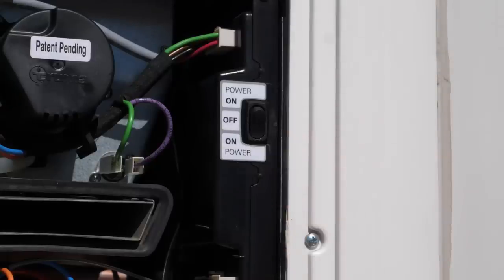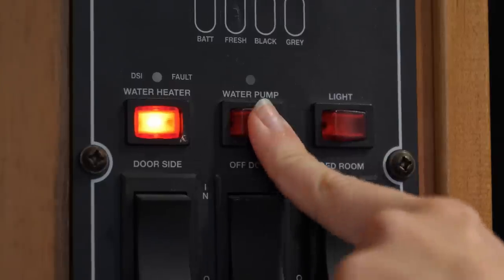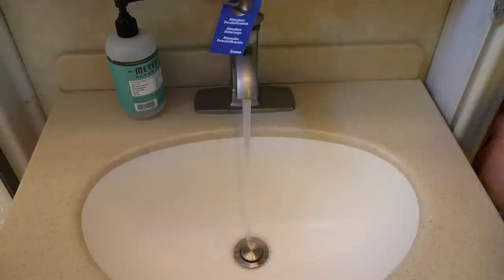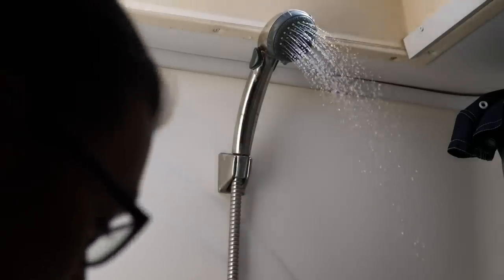Now lift up on the yellow drain lever until it clicks back into position. Switch the power back on at the appliance and turn on the fresh water supply to the RV or the water pump. Open the hot water taps to fill and vent the system. Once water flows uniformly the system is vented. The water may appear slightly red as the decalcification tablets dissolve quickly. Only run enough water to properly vent the system, as the dissolved decalcification tablets need to remain in the water heater.